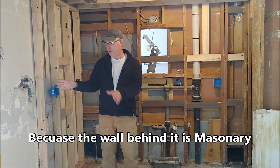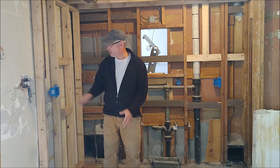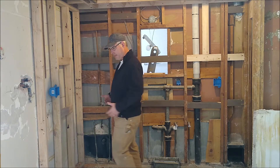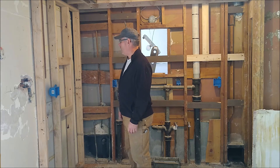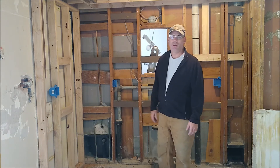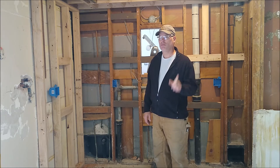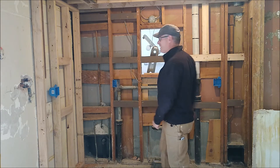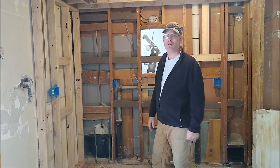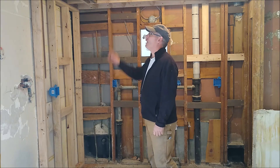The refrigerator goes here — it'll be recessed in the back instead of flush with the front of the cabinets, which makes it look nice. The second reason is my overall countertop length. I can't get anything longer than about 10 feet on a counter, and from here to there it's about 10 and a half feet, so this wall allows me to get a standard counter length and save money. All in all it made sense to add that little wall.